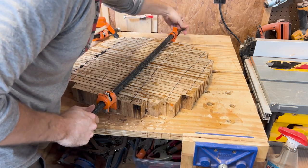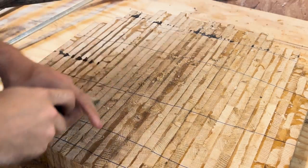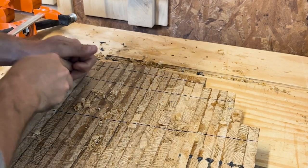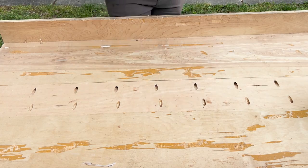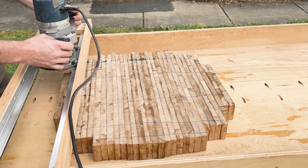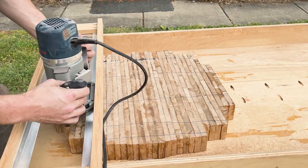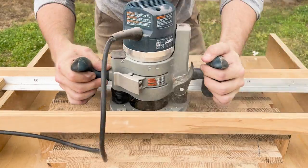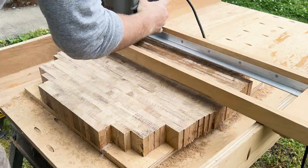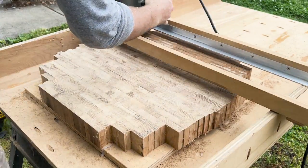I took my chisel and scraped off as much excess glue as I could before flattening. I obviously couldn't send it through the planer — it was just way too big, and end grain is really tough on blades, especially on hard white oak. So I grabbed my router and a flattening bit, made light passes to make one side completely flat, then did the same to the other side. I needed to take really shallow passes at the end once I removed the majority of material, just because end grain will tear out and leave rough pitted finishes across the surface even when it's completely flat.